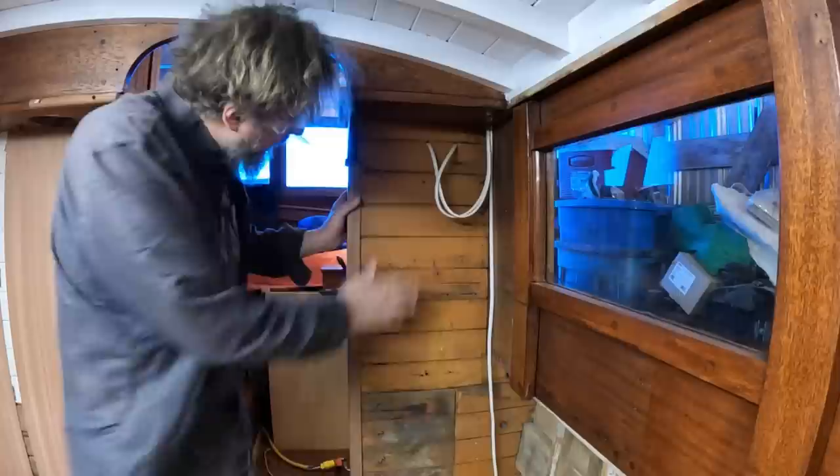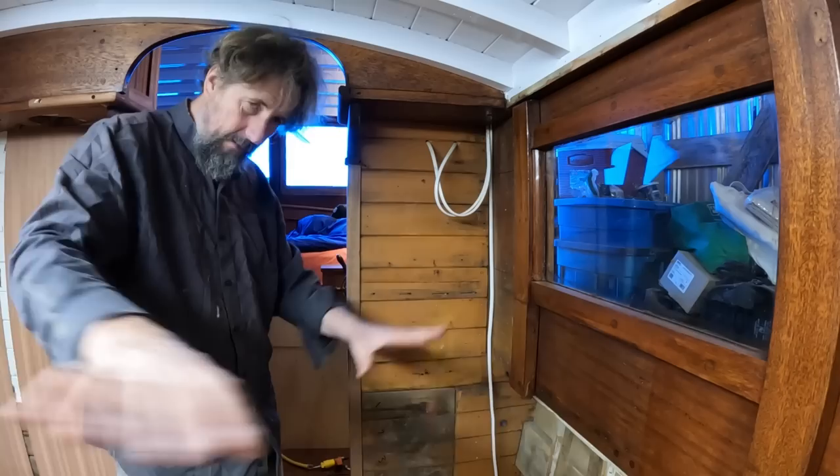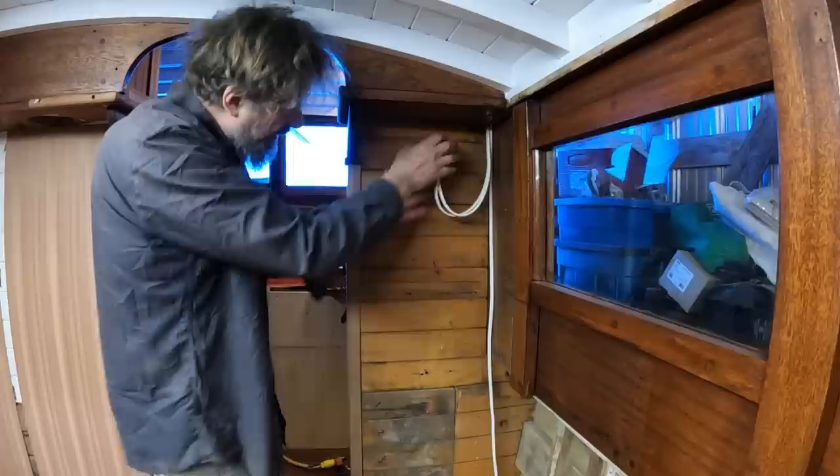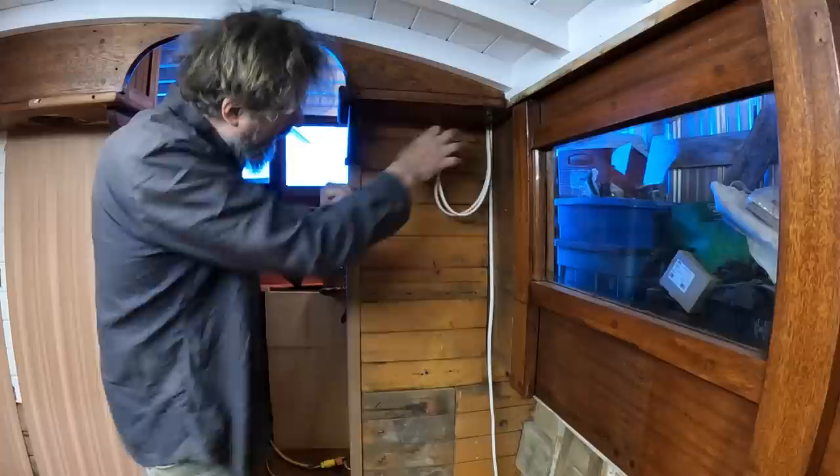And we're here. This is where that 13-inch piece comes in, just what I need here. This area here is going to be a credenza with a cabinet in it that will turn into the dresser. But right in this area is going to be the electrical panel. So it's going to be a wire chase, and that's why these two wires coming out from those switches are just fine. Anyway, I have to pull these wires out for now, re-drill them so that I can at least make that neat. So it means I have to take these switches off.